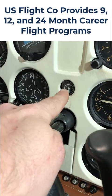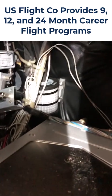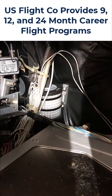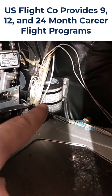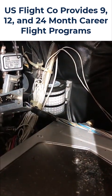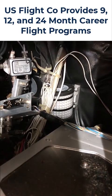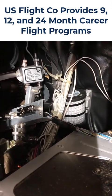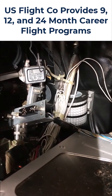The plumbing also has a T to give you a reading of suction or vacuum, so the vacuum system goes there as well. If we peek back here, you can see that cartridge filter — that is where the vacuum starts. When the vacuum pump is sucking air in, that little white canister is where the air comes in through the filter and then goes through the instruments. It also goes through a regulator back there.